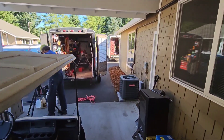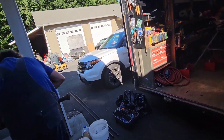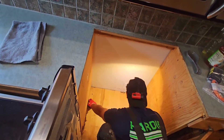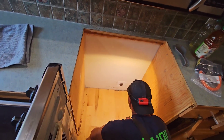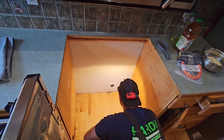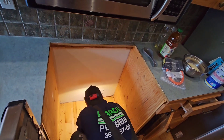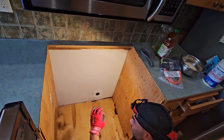Now we have to take off our tee. Dead center line is where we come through, just above the sill plate, and then we'll 90 immediately to the right. We'll put a gas cock right there and a plug or a cap. Do you want to go low? We're doing half-inch — we want to go three-quarters up.